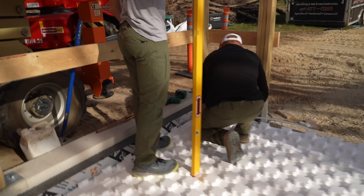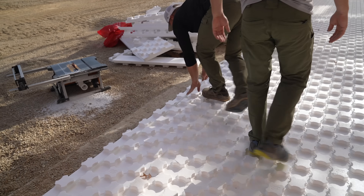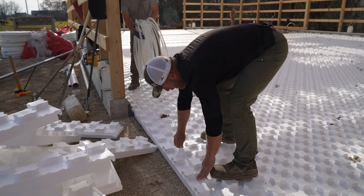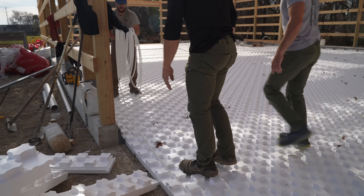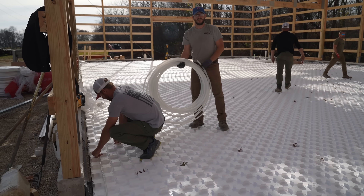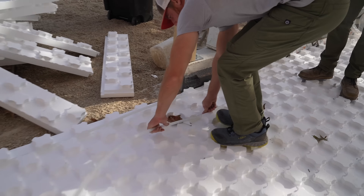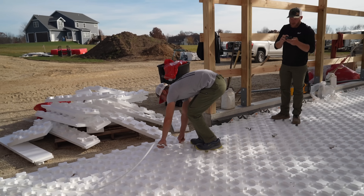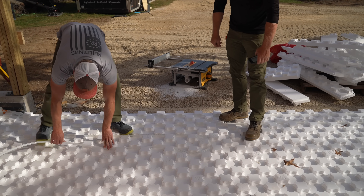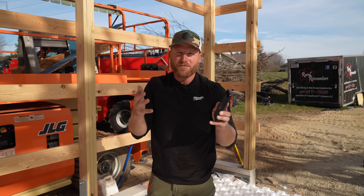We're working out the tube routing — checking if a bend is too tight. We're noting that if the outside of this building doesn't heat well, we'd know it's because of a kink right there. When you go through all the work to get an engineer design, why would you not follow it? Since we did, we're going to follow it to a T.